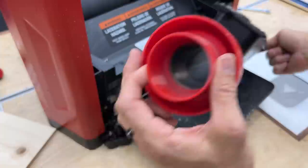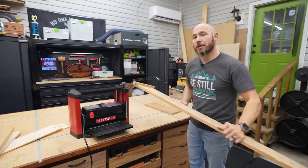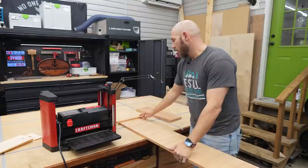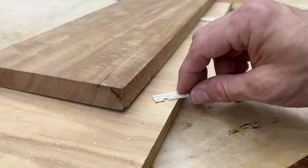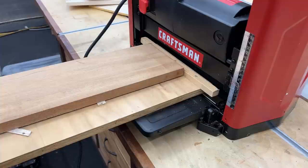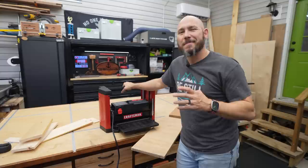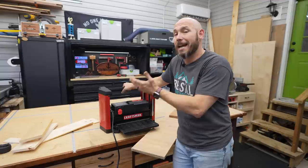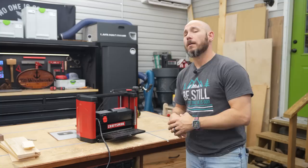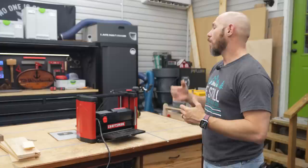You can also face joint on the planer using a planer sled. All this is is a piece of three-quarter inch plywood with a cleat screwed to the back. You run the cleat side first because the wheels pull toward that cleat — your board just has to be thicker than the cleat. If you have a twisted board, set it on the sled, shim up the gap on the raised corner, and run it through the planer. That flattens the top side; then take it off the sled, flip it over, and run it through again — and you've got two parallel sides. Being able to face joint with a planer sled is one reason I recommend getting a planer before a jointer if you have a table saw. Absolutely use some type of dust collection — a dust collector, shop vac, or separator — because it throws out a bunch of dust and chips.